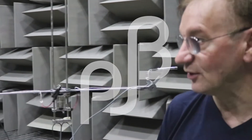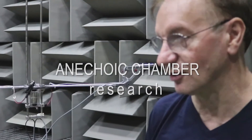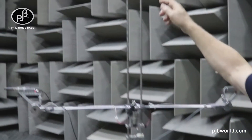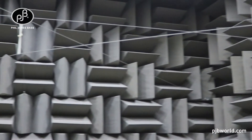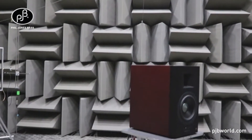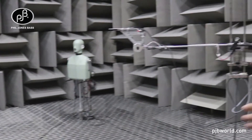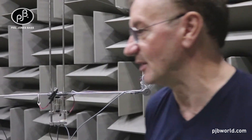This is how we do acoustic measurement of the loudspeaker, both on-axis and off-axis, including vertical and horizontal dispersion patterns. This is our microphone system suspended on suspension wires to make sure it's mechanically isolated from the floor, so we don't get any noise interference on the loudspeaker measurement — for example, if the speaker is producing a lot of bass, it won't resonate like a microphone stand and affect the measurement.